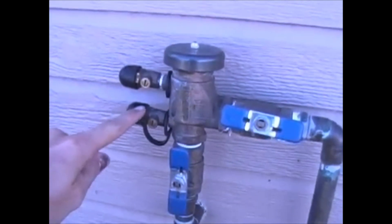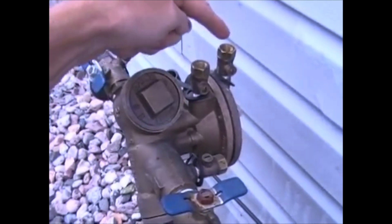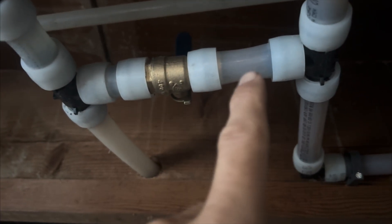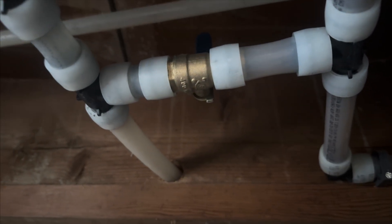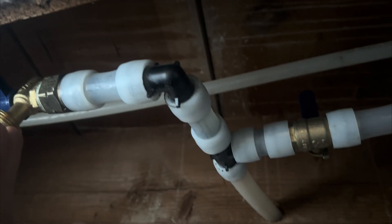Make sure that you've turned all of them. This device has two test ports. This reduced pressure backflow has four test ports. Inside the house, identify the water supply for the sprinkler system and shut it off. You can identify which pipes are for the irrigation — they are typically three-quarter inch, but there'll always be a shutoff and a drain right afterwards. Then you can follow this pipe and it goes all the way outside.